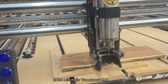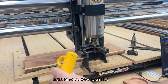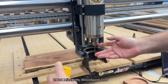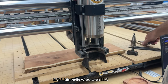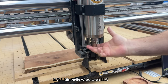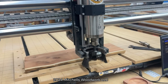I hit run. Alright, now it's right there where I need it to be. I've got my manual tool change button right here. I'm going to put my hand under here to catch the end mill when it drops out, and push that button. That took out the 3/16 inch end mill. To load up the surfacing bit, just stick it up in there as far as it'll go and press and hold the button for just a second. That baby's in there. We have now successfully loaded that tool manually.